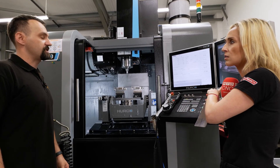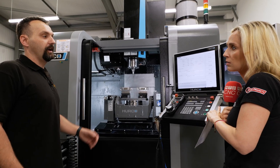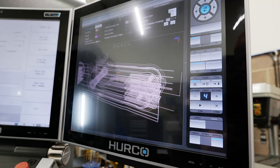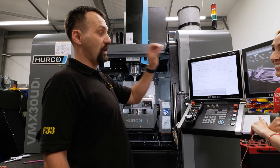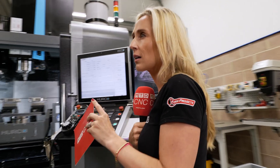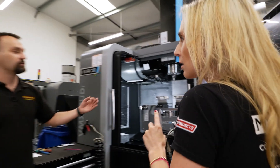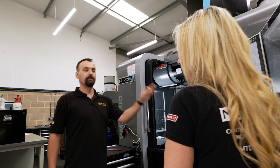Does that give you confidence? A lot of confidence, especially on full 5-axis moves. When this control actually simulates the tool going in 5-axis motion around the component, you can exactly see — even if the screen is covered with coolant — where the tool is on the part in real time. As a machinist, that means I know I will not produce a scrapped part. It makes it a lot easier to prove out the first component.